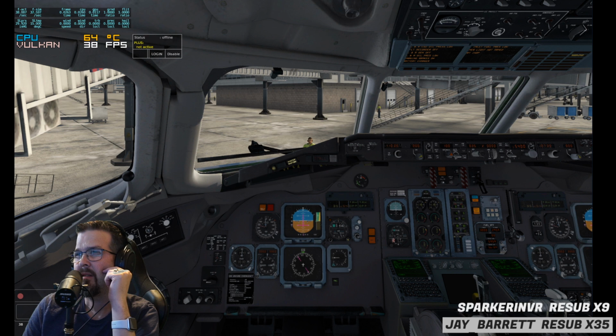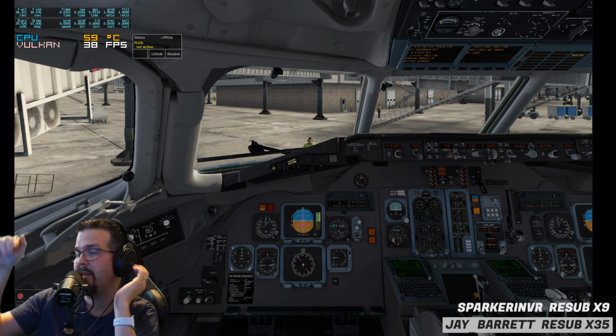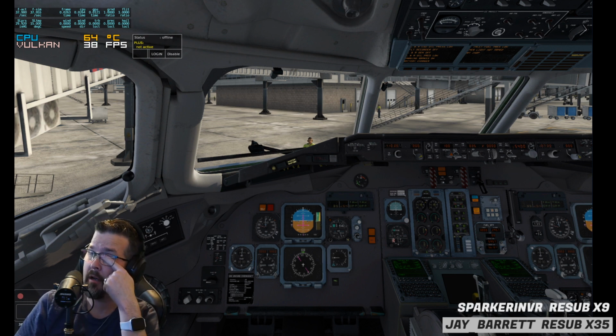No, I'm talking about the engine hydraulic pumps. I was just talking about the 737, not an NG. The 727 is a whole different ball game. But in the 737-800 and 900 that I fly, there's the electric hydraulics and there's the A and the B. I always shut the A off prior to taxi or tug push, and I leave the B's on.